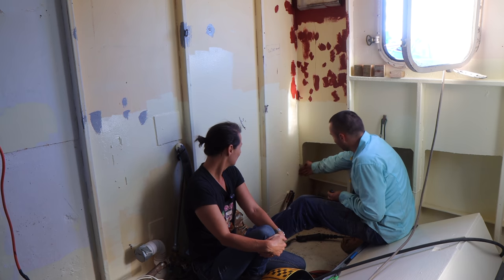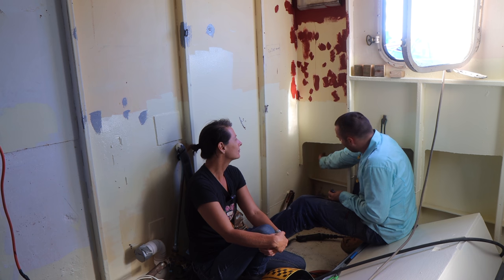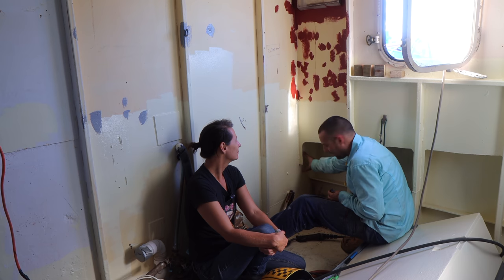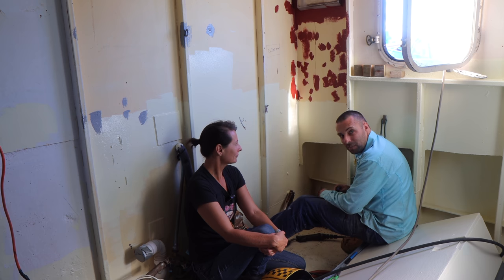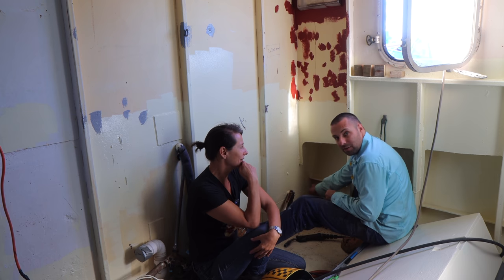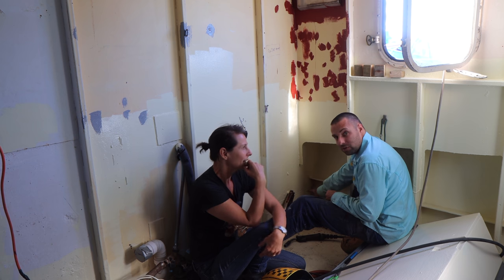And everything from that line there, that way, is outside of the cabin, but from here down, the deck is welded about there and sort of travels all the way back. There's a tank that's basically located up in here. It's a bit of a weird location, and there's not much else they could have done with it, but there is essentially just a big air void tank sitting in there, and it's got pinholes down here, so it will be rusting on the inside while oxygen can get in. So we just need to seal the oxygen off to stop the rust.